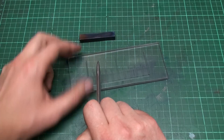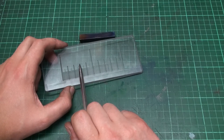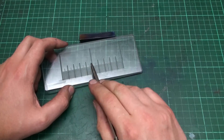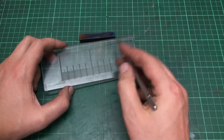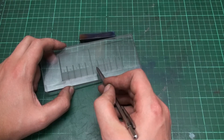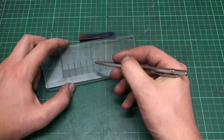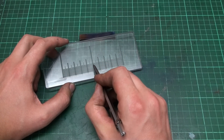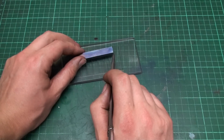That caused the variations in the scale I engraved. That's no problem — I can fix that. I'll make a new template with all the engravings cut at the same depth. I was thinking I would cut all the graduations that deep, but that wouldn't have worked out. So I had to pull back the engraving bit and lighten the passes, and that made these lines next to the big lines pretty much useless — that's what can be seen in this graduation.